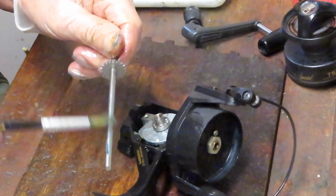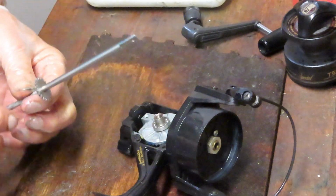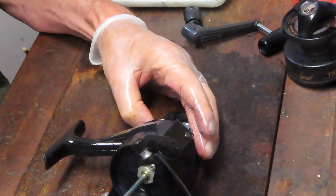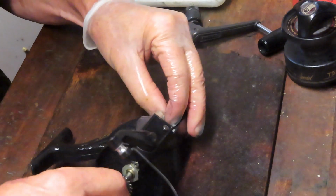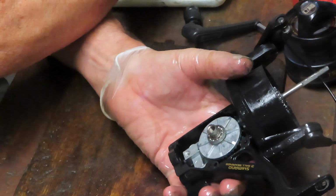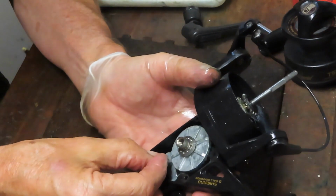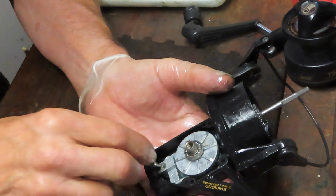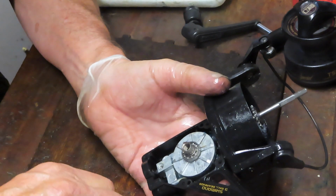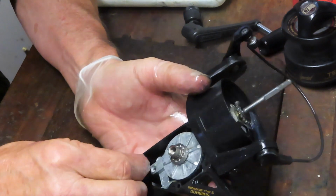Sometimes you'll find corrosion or dried grease or the like. You'll have to work with something a little bit more aggressive, maybe a kitchen scrubby or a very light steel wool. But for now, that one just wiped off with a paper towel. So kind of stay to the least abrasive you can. And now we've got the screw that came out of the holder. That's going to attach the axle shaft to the crosswind block.